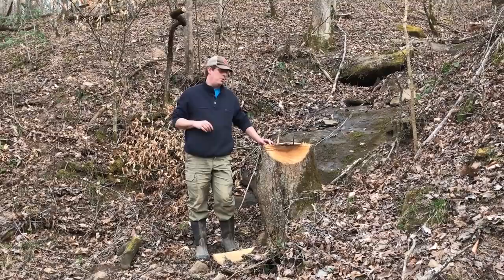So yeah, the real question is, and of course some of you guys that have sawn for a while are probably grimacing, saying, Troy, there's probably a reason why that tree had core rot. It could have been that something scuffed up against it and over time the heart rotted out of it, or it could be that there's a big chunk of metal in it. So we may discover that. Definitely. About 4 inches from the hole that's starting here, the core, you can see this grain discoloration.